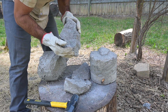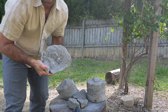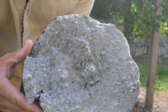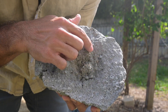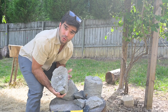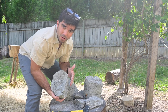I may have been wrong about dry pouring in layers. This could actually mean that it's a viable technique for these piers. One thing to notice are the air gaps — you can see from that piece right there that they're pretty small, but there are little pockets throughout the whole structure. That's not something you get when you mix concrete. It's not uniform, not the same throughout, whereas when you mix concrete it's not going to have those air pockets throughout any part of it.